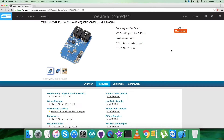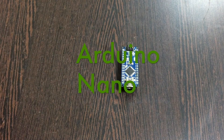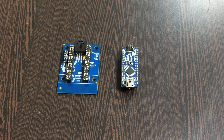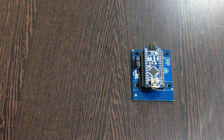Now let's have a look at the hardware connections we need to fulfill. The first thing we require is an Arduino Nano. We also have an I2C shield, available on controleverything.com, and we are using it to make connections with other I2C devices — it makes connections a lot easier. Gently place the Arduino Nano over the I2C shield to make the connection.